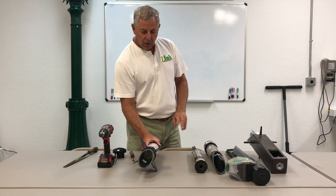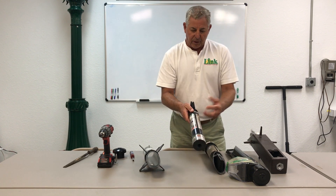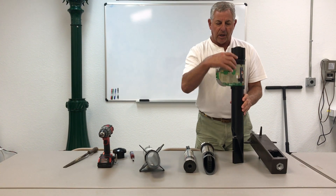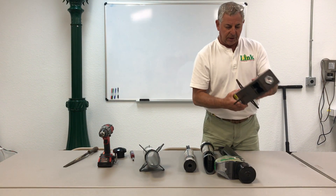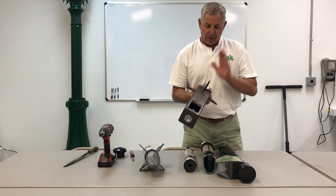By the way, on line voltage it is a UL-approved 120V connection point, so it's good to go. We also have them in a two-inch model — wings just not pre-installed — a three-inch model, same thing, and a three-inch model with an in-use cover and a receptacle box, which they call their Turtle Post. It's a very cool product.